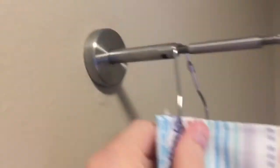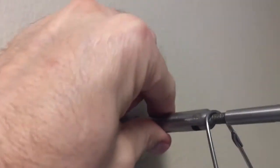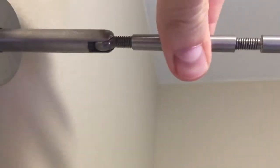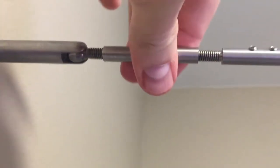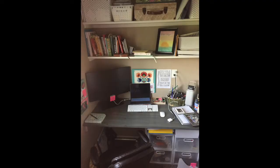So pretty efficient and very practical. Easy access — you can just cover it up anytime you want. And even if you're not on work conference calls, it's nice to just be able to hide some of that unsightly laundry mess that happens during the week. As you can see, it slides and glides very smoothly. You'll want to follow the instructions — they do indicate that you need to put that into a stud in the wall, so it's super secure. Don't want to just put that into drywall. It goes on really easily with no issues at all. They have these little covers with a couple of screws underneath. As far as tension goes, if you screw or unscrew this little piece, you can adjust the tension on the cable or wire itself, so you can get it pretty tight — nice, secure, and firm. It's very smooth with no hooks or hang-ups.